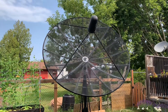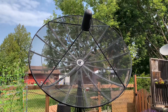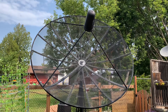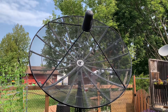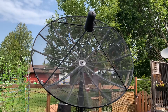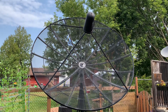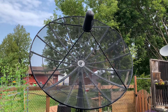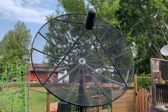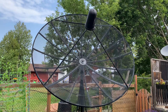Here's an update on what I've been doing with my C-band satellite dishes. This dish is a 10-foot Channel Master mesh dish and it's nice and easy to tune. It has these four arms or struts that support the LNB out at the front of the dish, which keeps it focused on the focal point of the dish nicely. I just got this one tuned in to SES-18 at Orbital Slot 103 West.